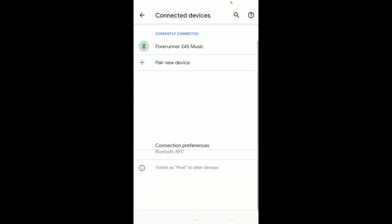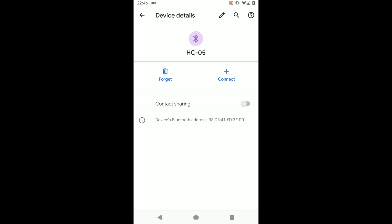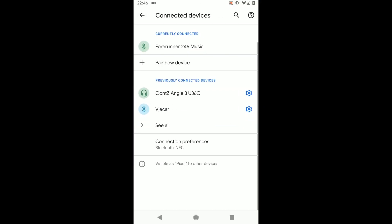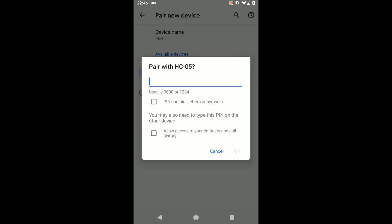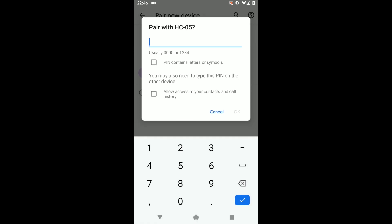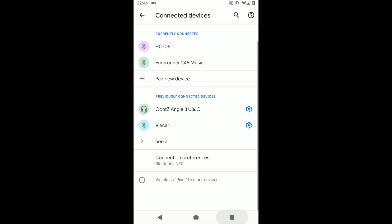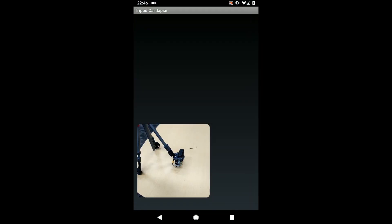You can see here my device — HC05 — which is this guy here, and it's already paired. If you don't know how to pair to an HC05, I'm going to forget it so you can see the process. It's looking for available devices — HC05 is here. It has this default password which is 1234. You do the pairing and it pairs up.